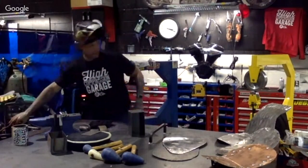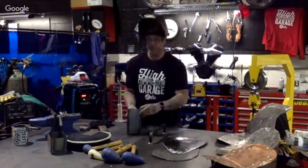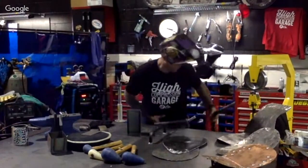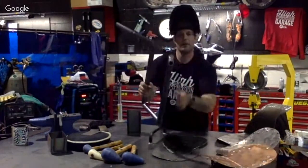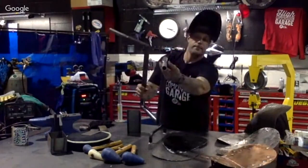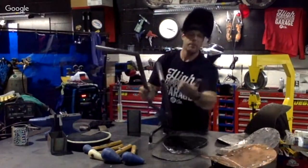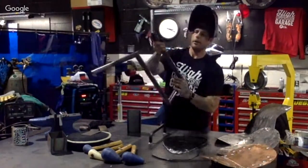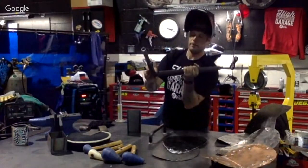This is what we're going to be doing a lot of the fine details with, our sissy bars, our handlebars, for instance. Let's see how close we can get you in on this one. All those were TIG weld on the outside. Same thing on here. We have to do very little grinding. The best part about TIG welding is that your finish is pretty much there. When we go under on our handlebars, you'll see that same thing with finish.